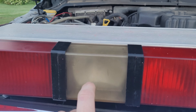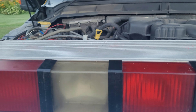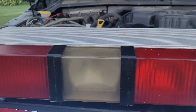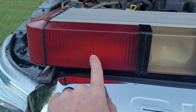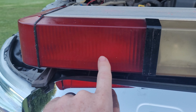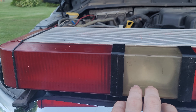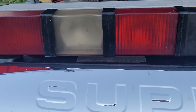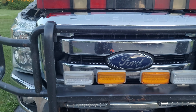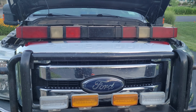The other big thing is that first-generation bars used plastic cutouts that sat further back in the bar to hold the modules in, whereas later generations had one-piece molding. These are all separate units. The strobe corner — which is a J-tube corner, by the way, you can kind of see it through the lens — that's a separate part. The halogen reflector is a separate part, the strobe tube is a separate part, and everything's held together with plastic and screws.